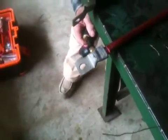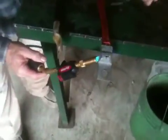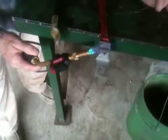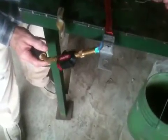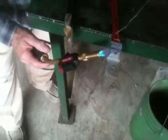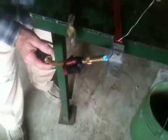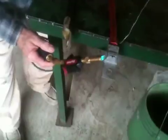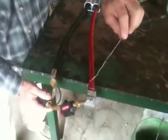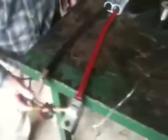When you're doing this, you don't want the open flame to be directly where you're actually soldering because it burns it up and doesn't heat evenly. You want to heat everything up and your solder will always flow towards the heated section. If I heat it over here, the solder will flow into the heat — whether you're brazing or soldering. Same goes for circuit boards.